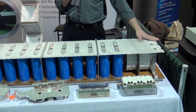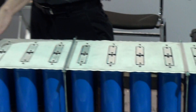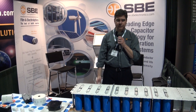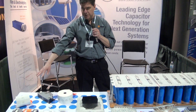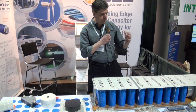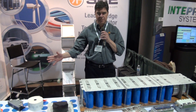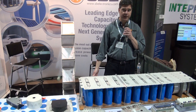This would be where the inverter switching would be connected and you would have your DC inputs over here. What's exciting about this is that if you did not have the film capacitors, the electrolytic bank would extend all the way across the table, as illustrated by these blue dots representing the footprint of the cans. With the simple addition of 1.5 millifarads of film, we take a 36 millifarad electrolytic bank down to an 18 millifarad electrolytic bank.